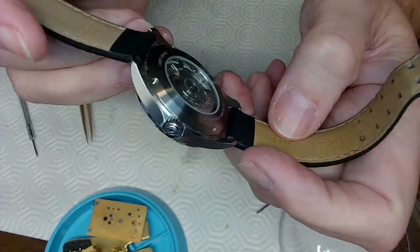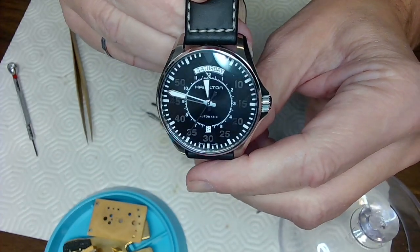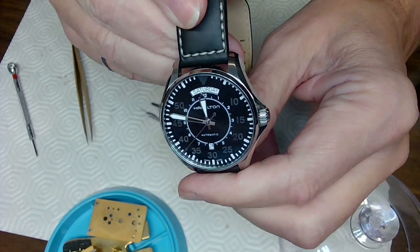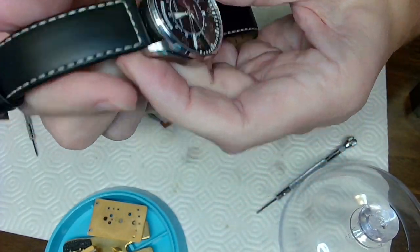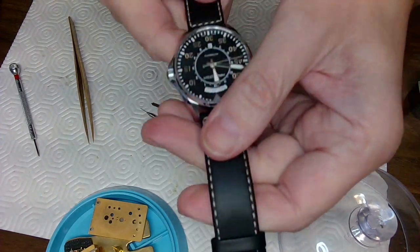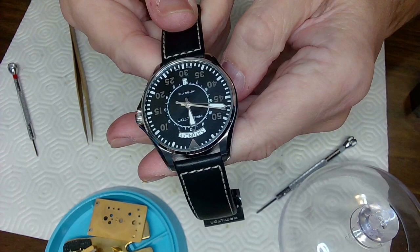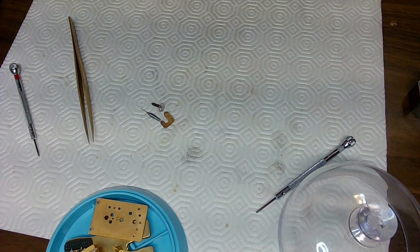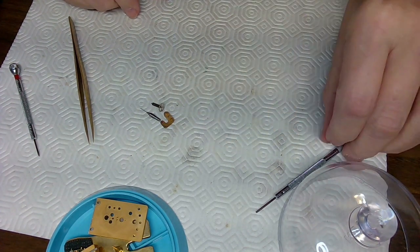This one has got a power reserve around 80 hours, I think, maybe more, but around 80 hours. So you can wear this, take it off on a Friday, put it back on a Monday, and it's still running. So that's what's cool. So they took a 28.8 movement, and they make it run at 21.6, which gives them the extra duration. So a little bit longer mainspring, and away you go, right? So that's the story. And I'm sticking with it.